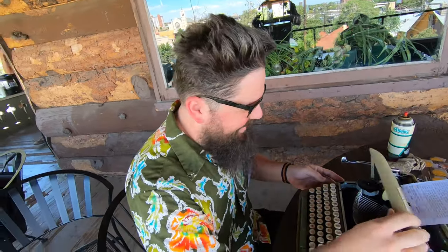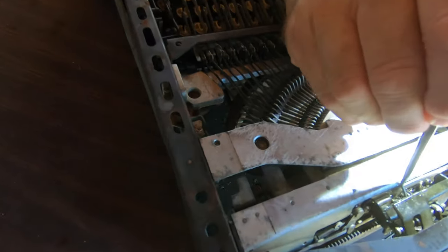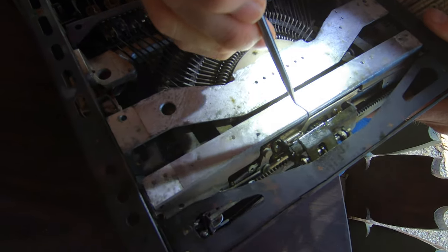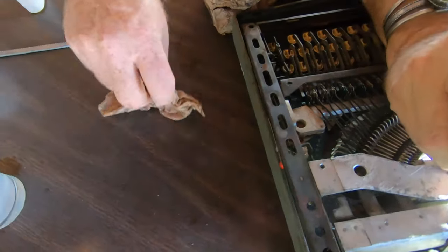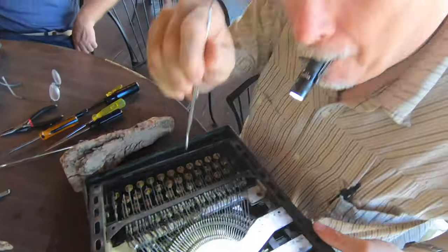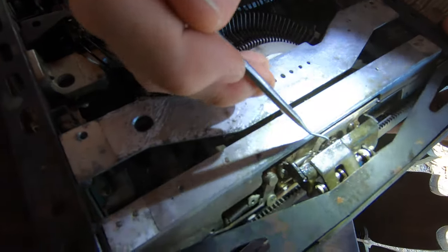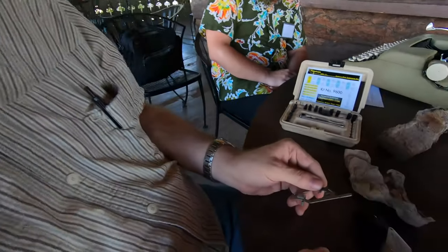What we have here is a Roxy, which is like a Roy, and the escapement isn't working — it's not moving the carriage when you space or when you type a character. We are deep into surgery now; we have the patient opened up. Nurse Kevin is cleaning up. We're trying to figure out if one of the dogs in the escapement may be stuck, and Bill here is cogitating on a little piece of metal.